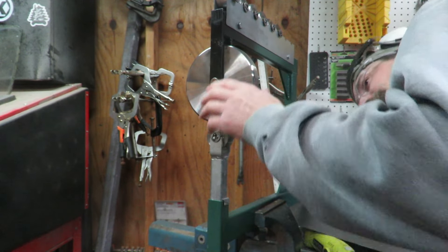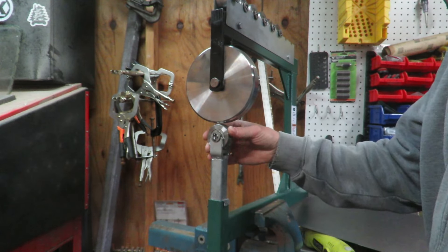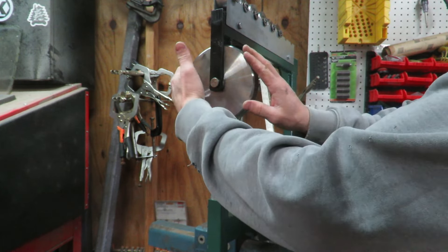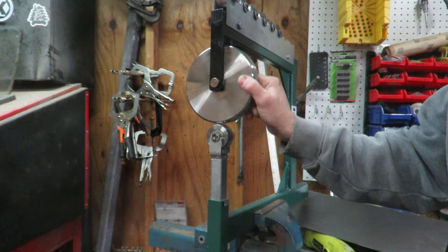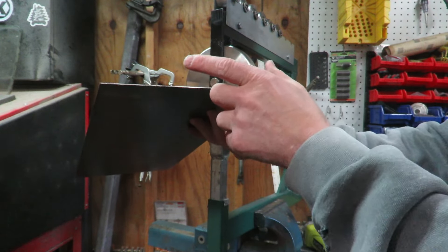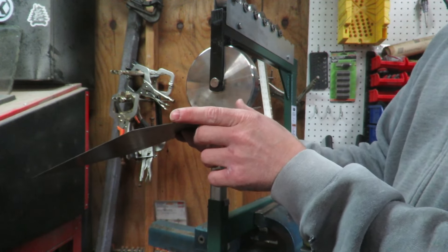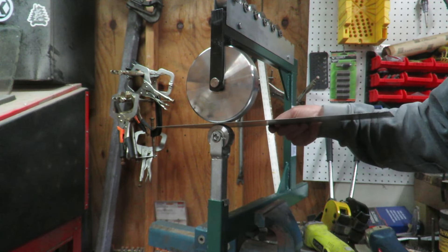I got the English wheel mounted up and I've got a slight radius die on here. I've had to do some work on this trying to get it to be a little bit better — when I first got this the top portion was actually twisted, that's why this is all black, because I had to heat this up and kind of bend it around. Works pretty good now. All I'm going to be doing right now is trying to get the shape of this to kind of match with what the car is. I don't have any of those gauges or anything, so I'm just pretty much running it and trying to get a little bit of shape to it, and then we'll fold over this edge and this back side. I'm still trying to learn how to use this thing and not pinch my fingers in it.